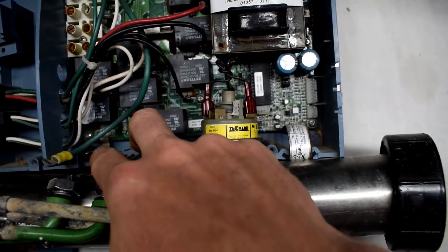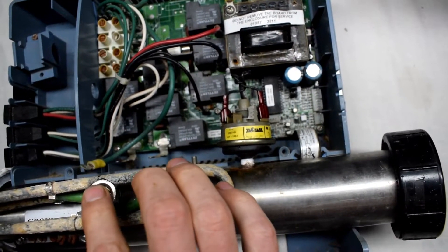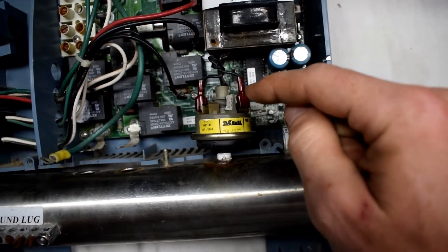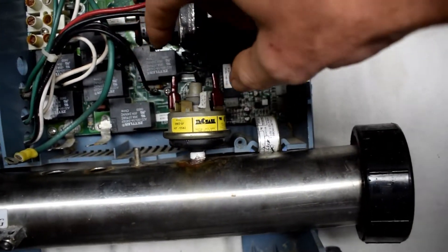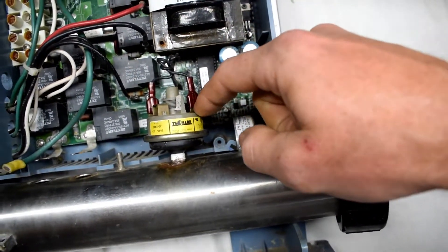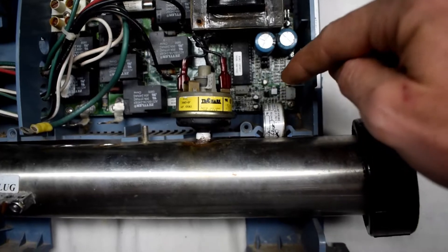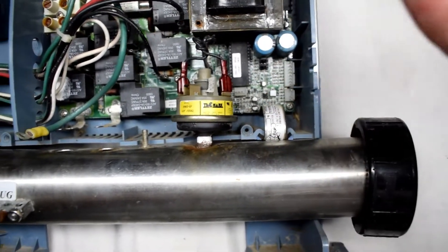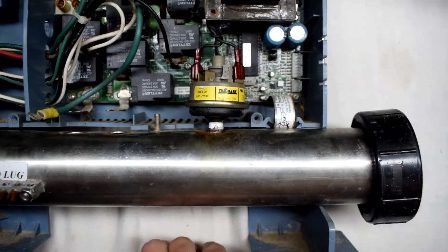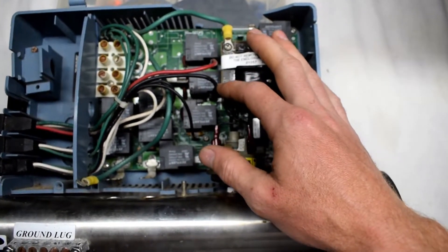I have another circuit board to give an overview of what the flashing lights mean. It could be a heating element issue, but in my case that's not the problem. There's also a pressure sensor — you should measure continuity between the two pins when water is flowing through it. There's also a high limit sensor that detects if the water is too hot. The previous owner had already replaced the heating element, the pressure sensor, and the temperature sensor.